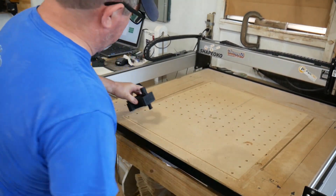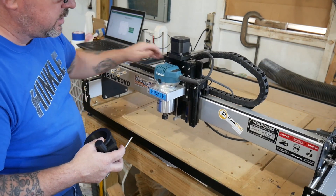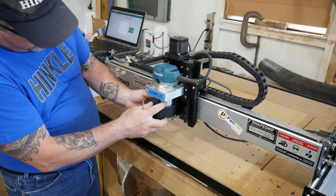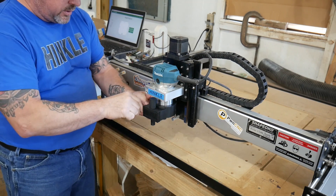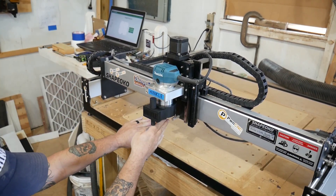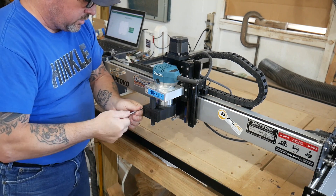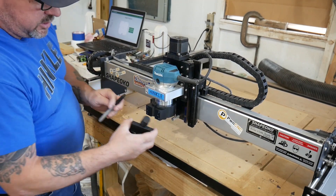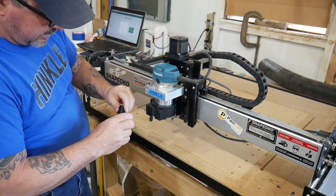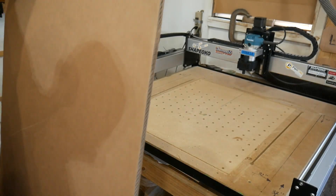Let me bring the machine forward and show you how easy it is to put this thing on. I removed the dust arms from the Bond CNC dust boot, and all you do is slide it on like so. I like to line up the cap with the bottom of this aluminum extrusion right here. Simple Allen wrench — tighten it up, snug it until you can just barely move it. Then I eyeball-line it with the center of the collet so that it's straight, and tighten it up. It doesn't move. Take the magnetic front off, take the cap off, load your marker, put your cap back on — and you just became an artist.